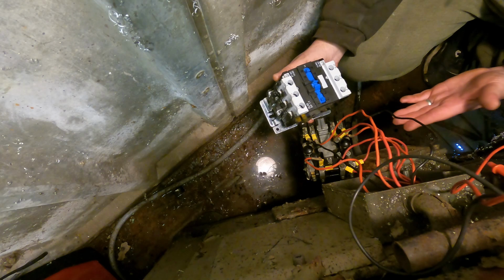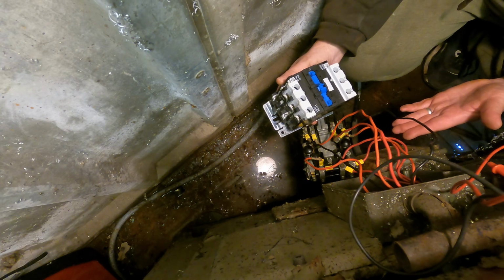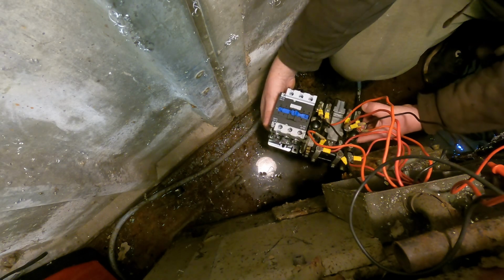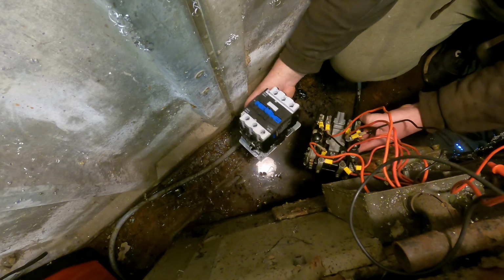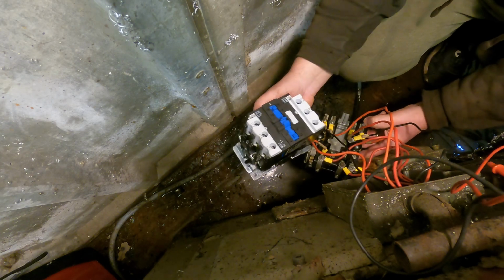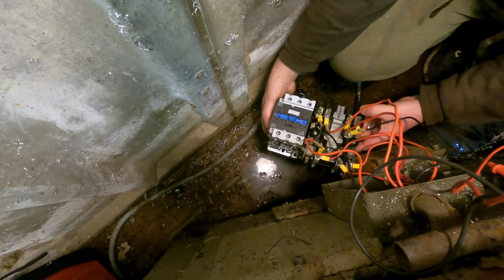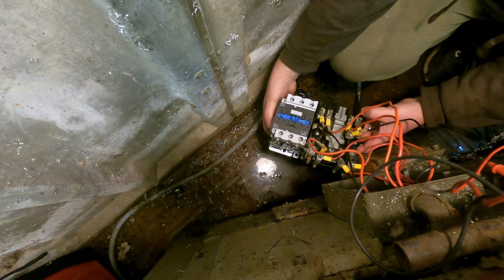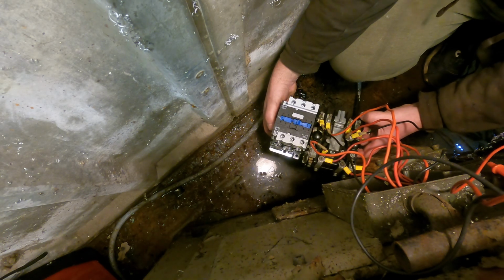if I'm doing it right. So basically the switches are the same. Obviously one's very old and the other one's a new modern one. So the lathe's 3-phase and I've got a 3-phase switch. So I'm guessing if I do it like for like, wiring it up, I think I should be right. So what I'll do is I'll take one wire off at a time and replace them. So that's my plan.